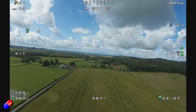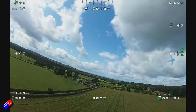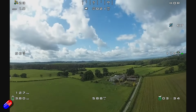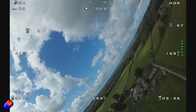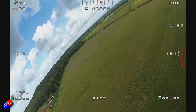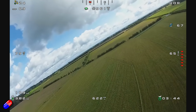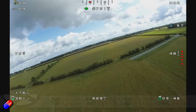I'm going to take off probably that mix of elevator on the V-tail to calm that down a little bit. I think I need to get rid of that in order to be in with a chance of setting up some kind of iNav trim, but I'm flying it a lot in manual in these test flights and finding that that pitch response is just too aggressive.